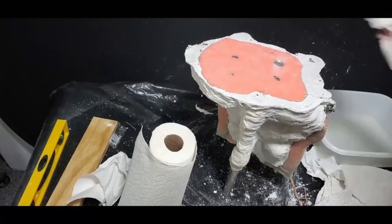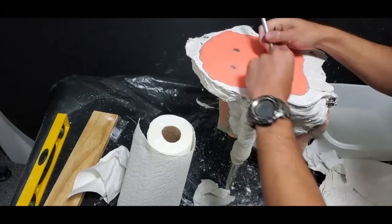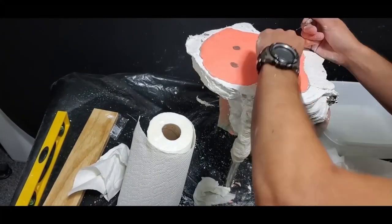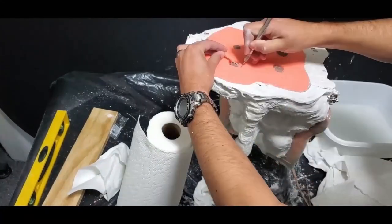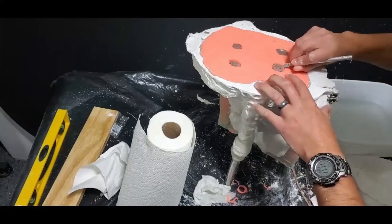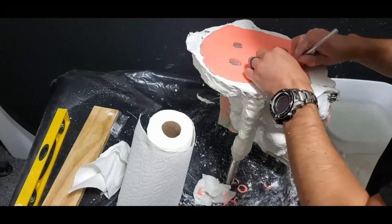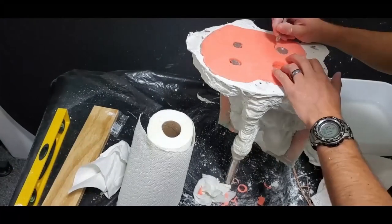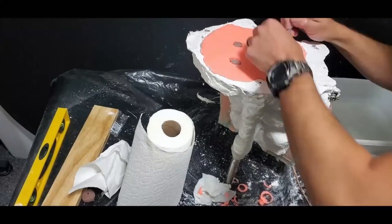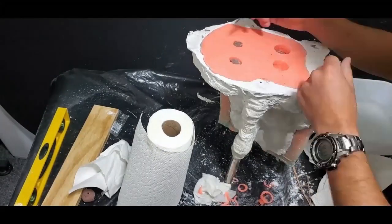The mold sits just fine upside down. I'm cleaning it off and can see the four little spots where the oil-based clay balls were — the ones the original sculpture rested on so the rubber could flow underneath. Now I'm having to remove those balls and will partially fill the resulting craters with platinum-cure silicone rubber, so the bottom becomes solid.